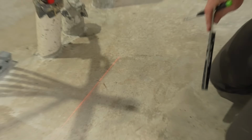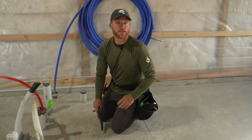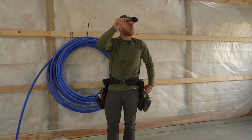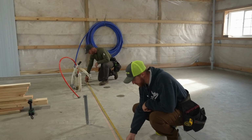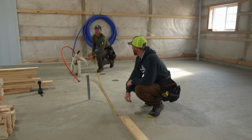All right. Now, Greg, let's go ahead and fill out. Let's get 16 footers. We'll cut them down to 16s. We'll get it filled out here. We'll get our double plate, and then we'll figure our elevation. I'm gonna assume we're gonna go to this point for now. So we're gonna cut one at 10'6¼".